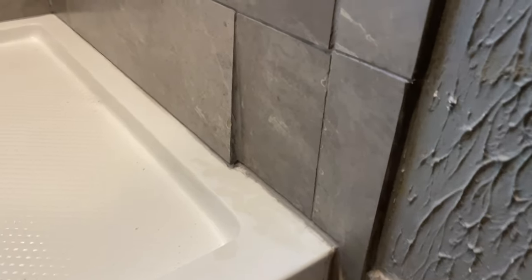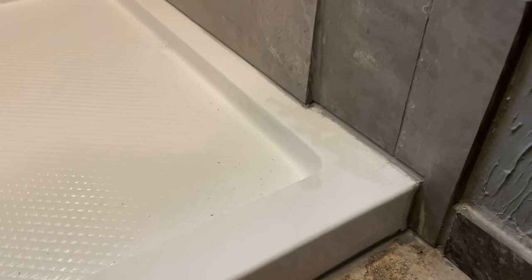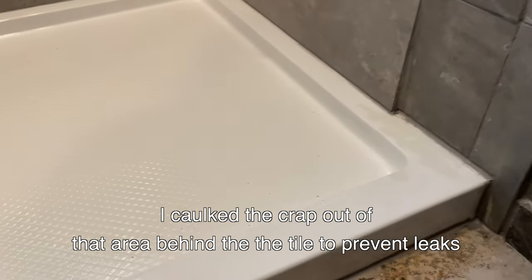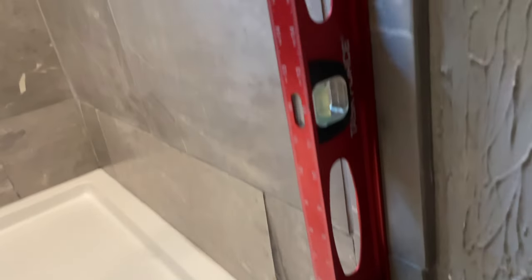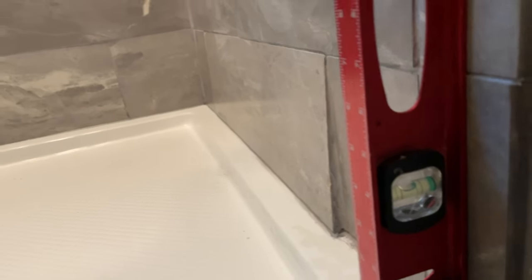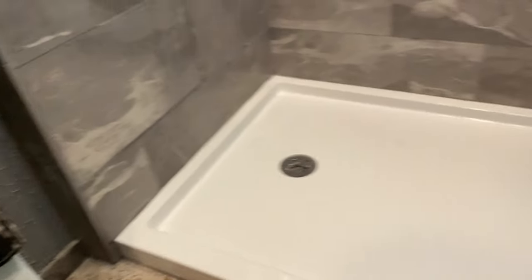This doesn't look great - as you can see it crops up, and that's because the lip on the end of this shower pan is behind it. I cut it out of this area right here, which I really didn't want to do, but this needed to be level. If you take this level and put it here, that's within the lines - that has to be level in order to be parallel with the opposite side for the shower door to sit in there. I could have taken all of these pieces out and it would have looked better aesthetically, but I was a little concerned with leakage, so I just let it go.